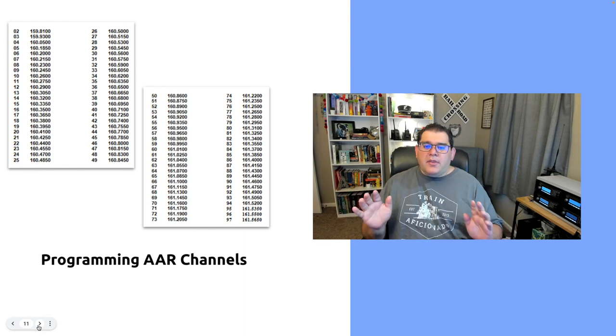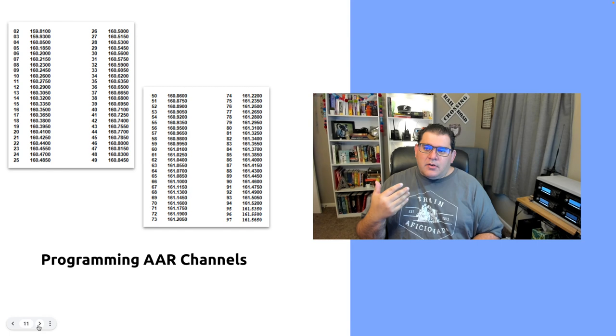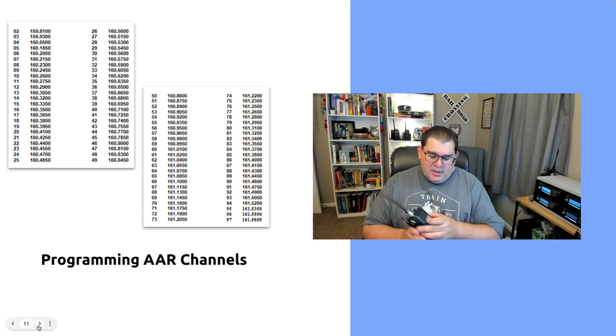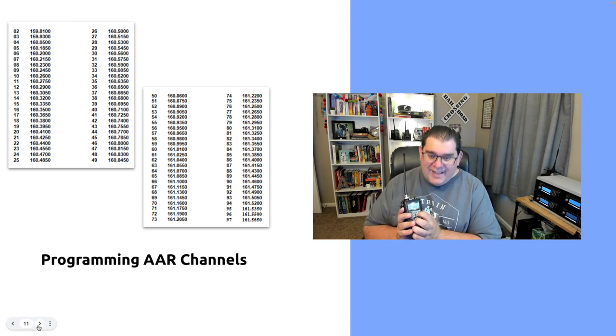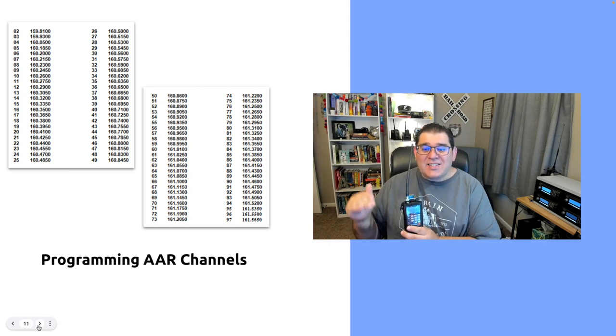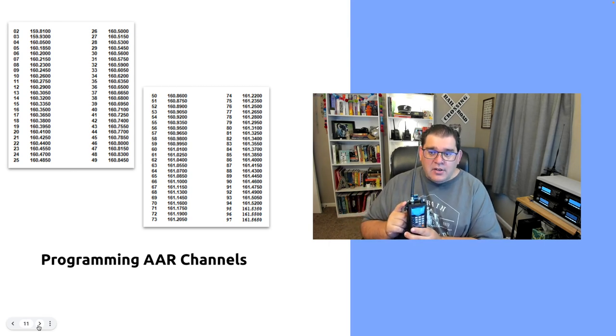Now, why do you want to go through all that trouble? Let's say you're taking a railfanning trip and you've written down all the frequencies, but something got changed. They changed their road channel. Or let's say they say go to 18, and you think, what the heck is 18? What you can do on your 125AT is press the hold button, press 1-8, and then hold. It'll bring you to channel 18 because you went through all the trouble of programming all 97 railroad frequencies into your scanner. So that means you can hop to whatever channel they go to quickly.